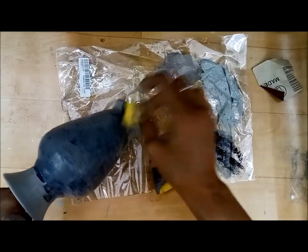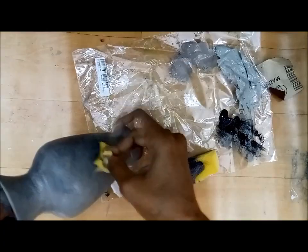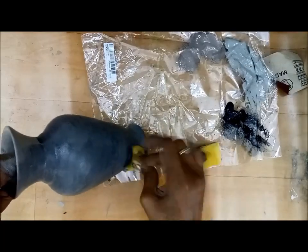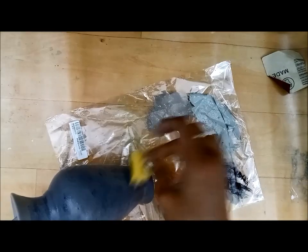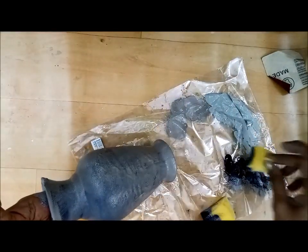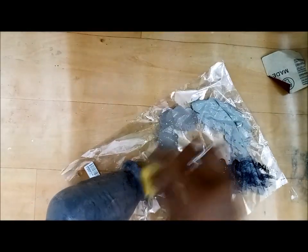When the base color is a little wet, the blending is easy. Just in case your chalk paint has dried before you bring in the top coat or want to blend, just dampen the sponge you're using for application and that should take care of blending. In this case I'm not doing that because my paint is still wet. Mind you, this is just one coat of chalk paint, and I'm coming over it with a little black acrylic paint. If you have black chalk paint you could use that too — basically trying to darken the tone in spots here and there.